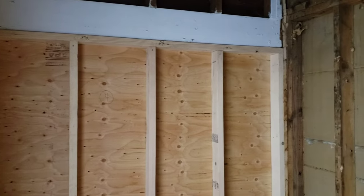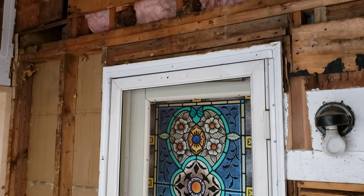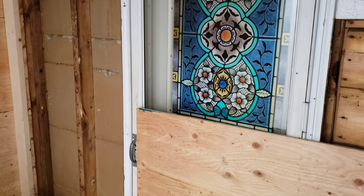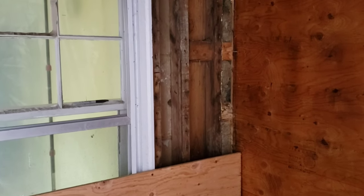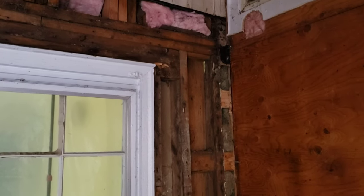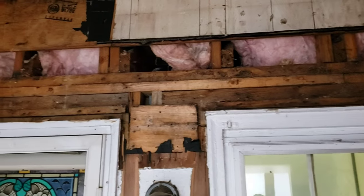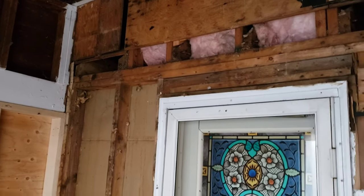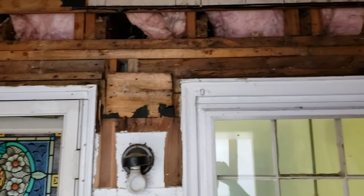This is the lay of the land inside the enclosure that Steve built to extend the kitchen. As you can see, he's got all the sheeting off this wall. On the left side you can see there's just exposed sheetrock, which represents the inside wall of the kitchen. He put a temporary piece of plywood in here — I imagine this is to lend some stability to the structure while the sheeting is off. The key thing Steve needs to do is get this demoed enough so this horizontal beam that goes across here can be reinforced, because the span of this opening needs to support the weight above it. He's going to work on this beam first, then take these two-by-fours out of the way one by one as he gets it fit in along that horizontal plane.